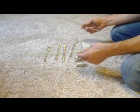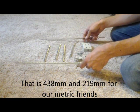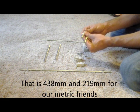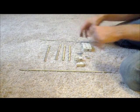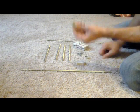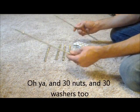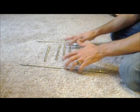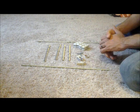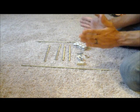So to begin with, I've gotten two long pieces of threaded rod. These are 17 and a quarter inches long, as well as four smaller pieces that are 8.625 inches long — four corner posts, the motor mount, and the Y belt receiver, as well as a bearing. I was able to get all these pieces, plus a short extra piece, out of a single 72-inch long piece of threaded rod, which works out great. So let's begin.